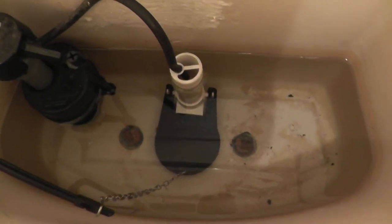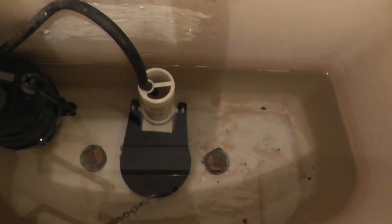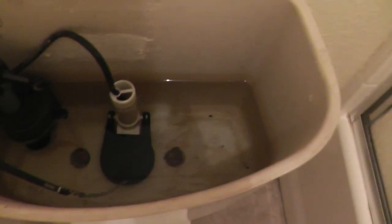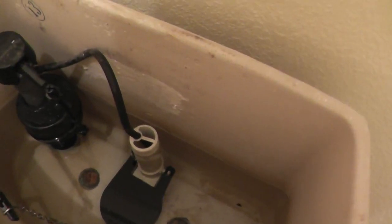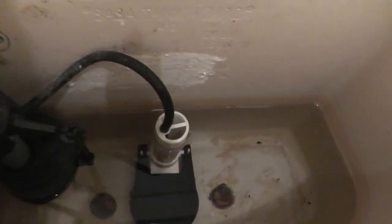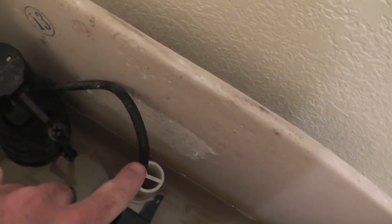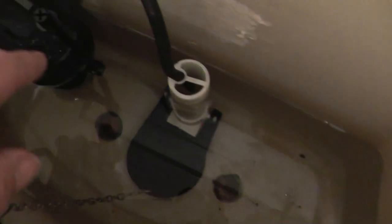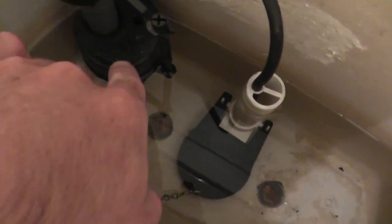This is caused by water leaking past the flapper valve — that black circular thing in the middle of the tank. That little bit of water leaks down into the bowl here, and the symptom of that is every once in a while the water level will get down low enough that this valve here will have to let more water into the toilet. Water comes in down through the valve and through this pipe to fill the tank and the bowl. When this float gets high enough, it shuts off this valve.